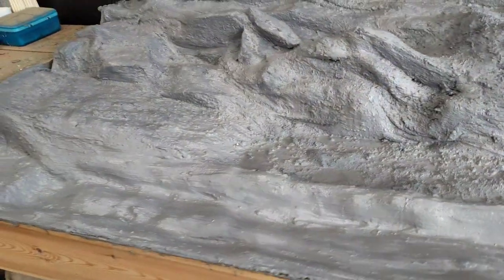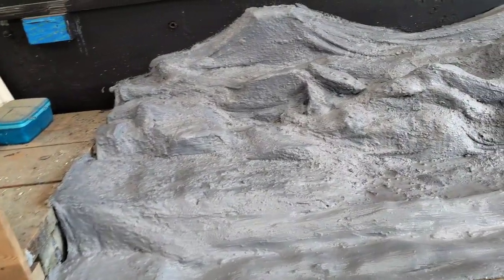I'm just slapping it on now. The river I've put on quite thick — I didn't water it down, just nice and thick for a good couple of coats. But the rest of it just needs a wash, so once I did the river run I added a bit of water, topped it right up, and just wash over the whole lot. It will still give protection and a waterproof layer because the glue is in there and it's going to seep deep into the concrete. There it is — just keeping that nice consistency going throughout the whole thing.